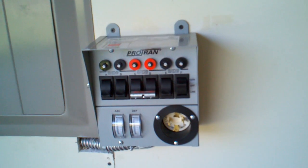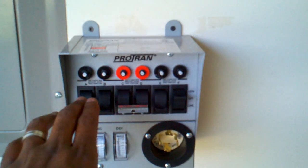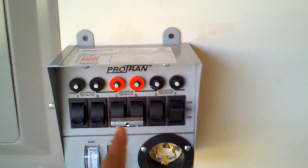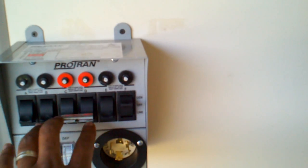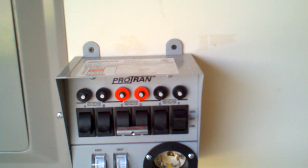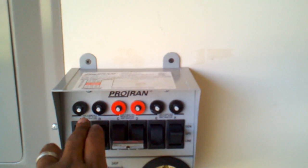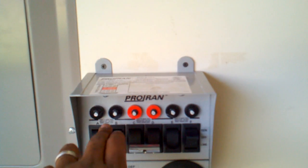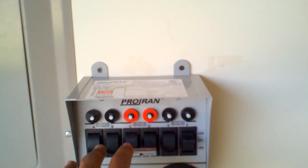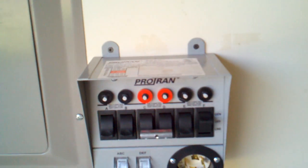We're talking the main rooms of the house. This transfer switch satisfies a couple of purposes. One, it allows me to take any six primary circuits off the grid. And also it provides a circuit breaker function too. So this provides the overcurrent protection on the AC side of my inverter.